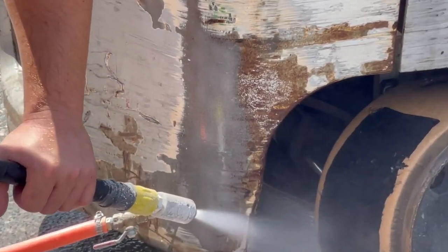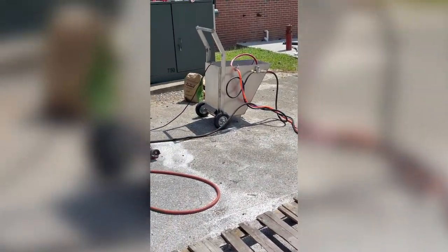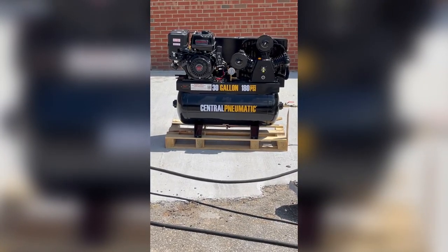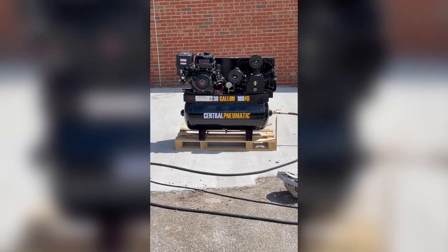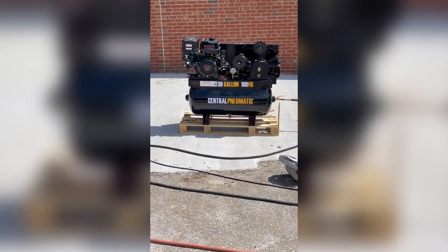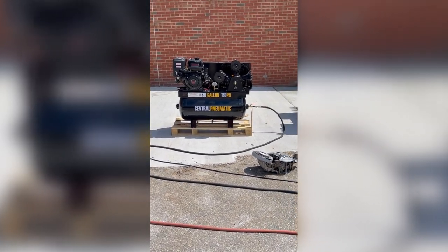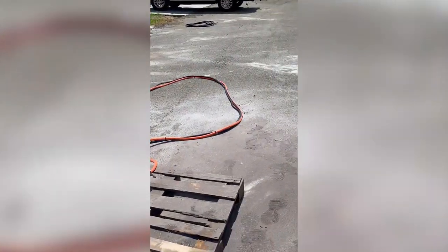This mobile machine is really, really sweet. We're running it off a 30-gallon Harbor Freight compressor. This unit costs $1,500 — very affordable, works very well. We're running at 115 PSI on the blasting machine right now, and this compressor will maintain 130 PSI while we're blasting. Remarkable results from this setup.